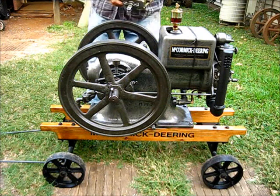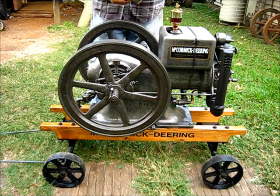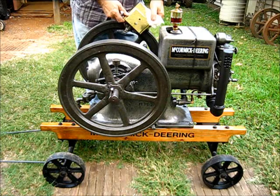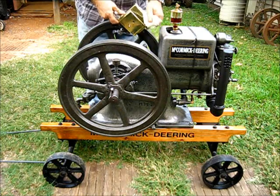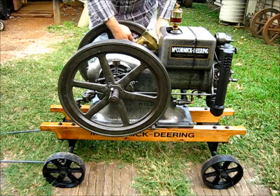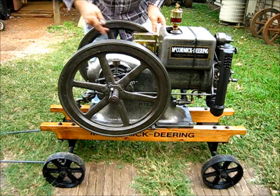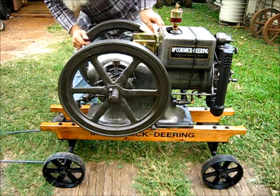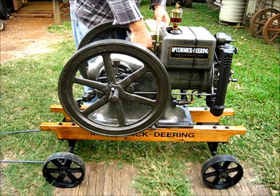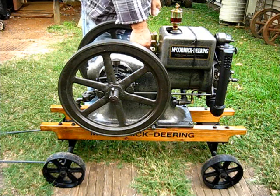Boiled linseed oil on all of the bare metal parts. This one does have the cover on it but does not have the stop button on it. To put that on there, you just put it right down in there — that pin has been set tight. Put it right down in there like that, put it in that bottom hole, twist it around, and if it don't fall in, move your flywheel to where it'll fall in. That one went right up in there.